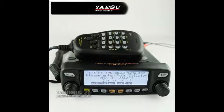And I'll demonstrate how to get into both. Because in PDN mode, you will only be able to connect to a digital-only room. So you need to put your radio in HRI mode, which is a different command, and then you can connect to any room, whether it's a mixed room or not. Of course, if anyone comes in on analog, you won't hear them, but I don't know of any systems running analog anyway, so that $80 cable is not necessary. The SCU20 cable that came with your radio is perfectly adequate.